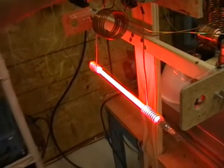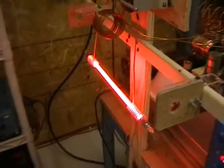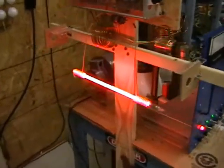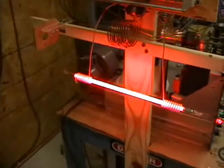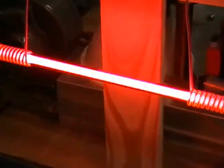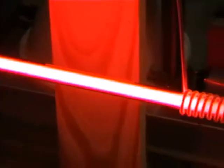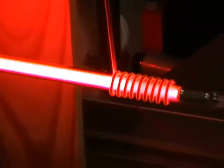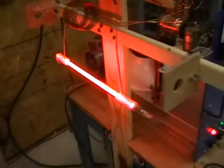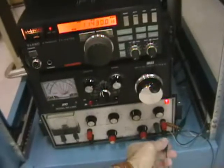What is happening at this point is approximately 70 watts of the 100 watts coming out of the 747 is being fed directly through the amplifier into the tube. That is sufficient to light the tube, but we want to use more power to operate the system. So the next thing we'll do is get the amplifier in full operation. To do that, we turn the 747 off — now there is no power — and we remove the high voltage shorting wire.